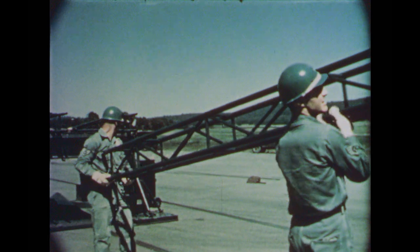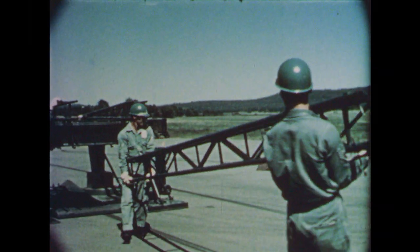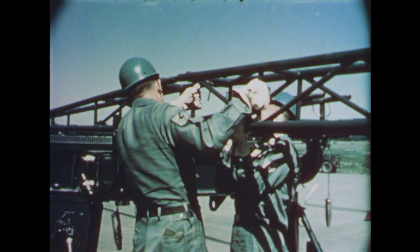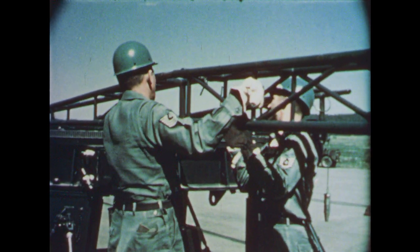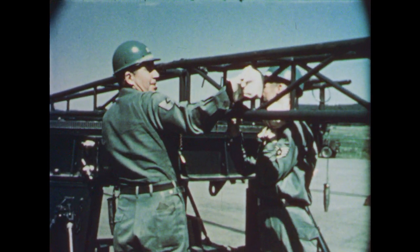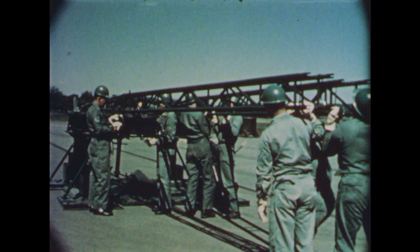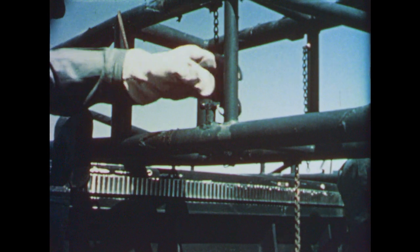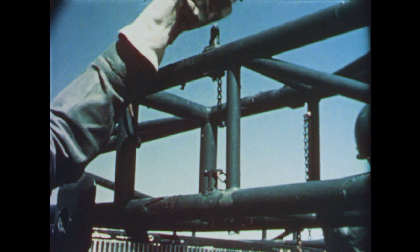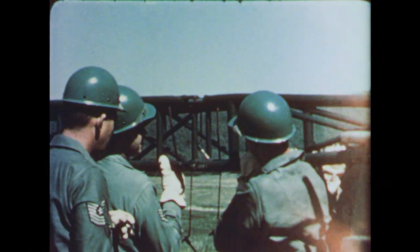When both lower sections of the A-frame are in place, the center sections are unloaded from inside the H-frame sections. Sections of the frame are joined at machined slip joints. Because of fairly close tolerances, an approximate alignment has to be accomplished before the joints will slip together. Self-locking pins hold all sections in place. The upper section is now attached to the center sections.